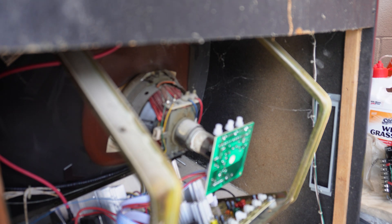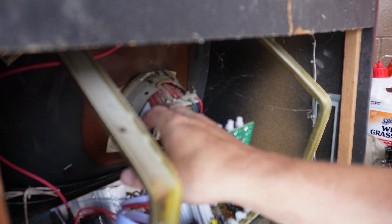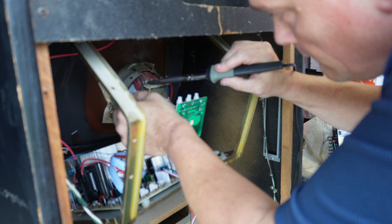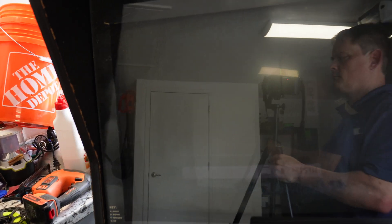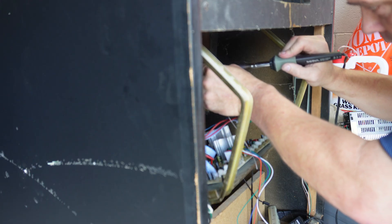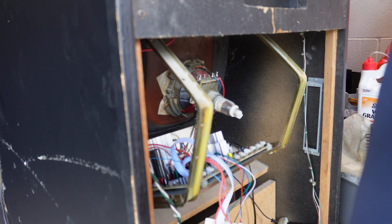I got the power off to the monitor and the cabinet. These are the yellow and green wires I need to reverse — they drive an electromagnetic coil that helps steer the beam around the monitor. Obviously I was wrong, because the image went upside down, so green and yellow are my vertical yoke and red and blue is my horizontal yoke. Had I done this a little more frequently, I would have remembered that. The lesson here is always check Google before you start soldering.